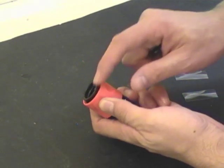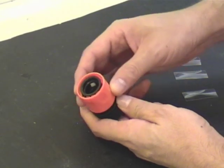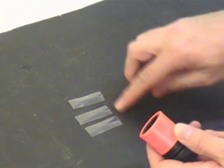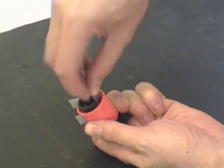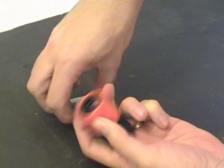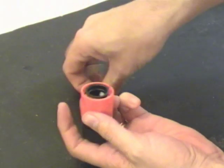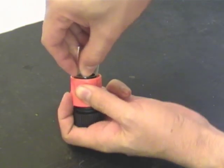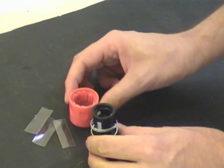In order to sand down that front face, the best thing to do is to remove the orange collar from the Quick Connect. You end up using three strips of PET plastic just cut from a bottle, and you insert them under the tabs. Do that all the way around. Once they're all in, all you have to do is pull back and it all comes apart.